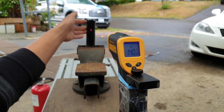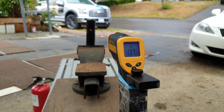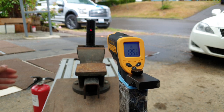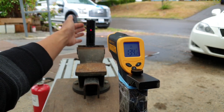This is weird — it's hot but not burning hot. We're at 10 minutes. This test is just to prove that the electronics can handle heat a lot better than our skin. As a safety measure, per my Sky Lumen purchase agreement, you have to always monitor the heat with bare hands, and if the light is too hot to hold you gotta throttle back. This test is only to prove that the electronics can take the heat. It's hot now — 135 Fahrenheit. At this point I think it's hot enough that if I want to handle it I would have to pass it back and forth between my hands.